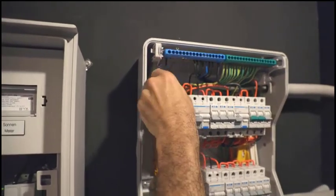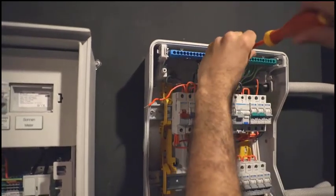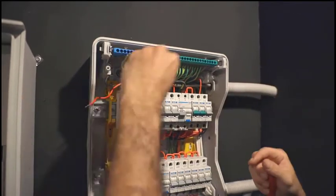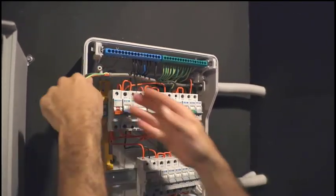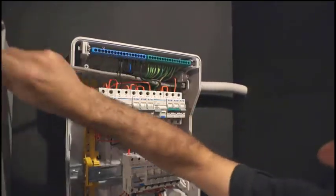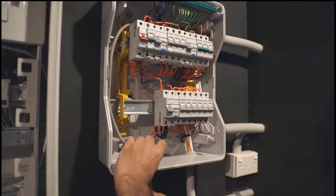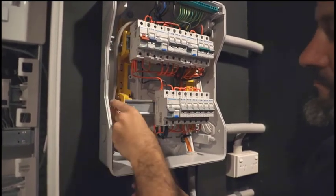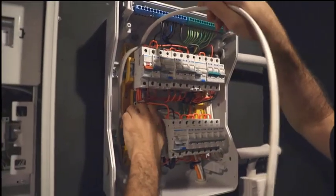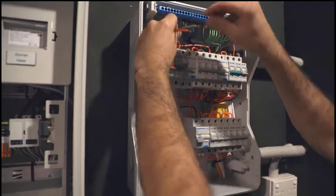So step one of the wiring is to locate the main incoming supply from the grid. So this cable here, for illustration purposes, is the existing grid supply, which we're extending out to take that straight to the Protect-Plus. We then obviously have to have a return cable coming back from the Protect-Plus to replace the previous grid supply. This is now going to become the supply to what we'd see as being the normal or nominal loads.